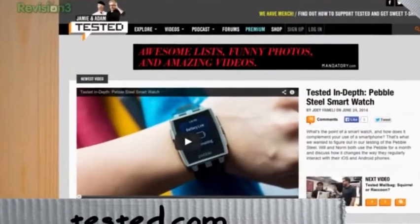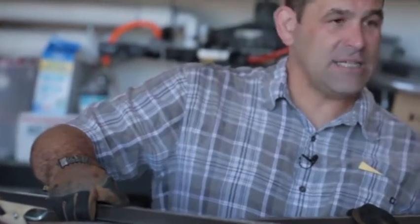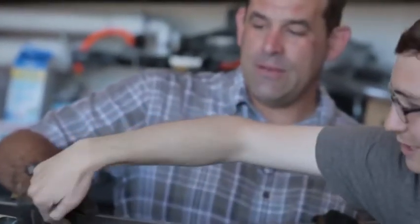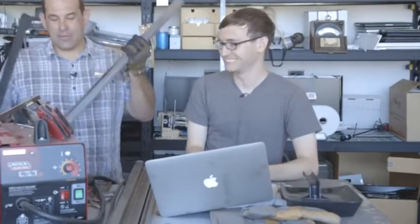And we're going to take some 1-inch steel, which I learned about being the coolest thing on the planet from Jamie Hyneman. Shout out to Tested.com, our buddy Will over there, who did a video with Jamie about welding in Jamie's workshop. Apparently all those shelves you see in the back of the MythBusters shop are 1-inch steel. He loves it because you get lots of contact area, a big long line that you can just put a bead of molten metal on, without having to spend a lot of quality time doing miter cuts and getting sophisticated. And steel is durable, it lasts a really long time.